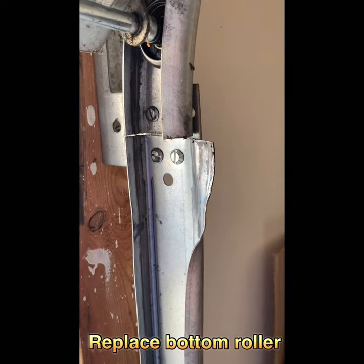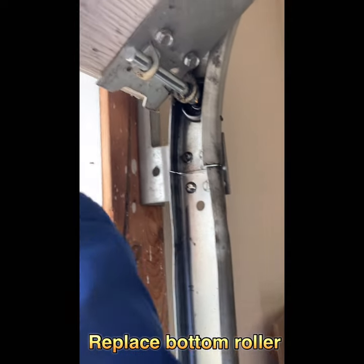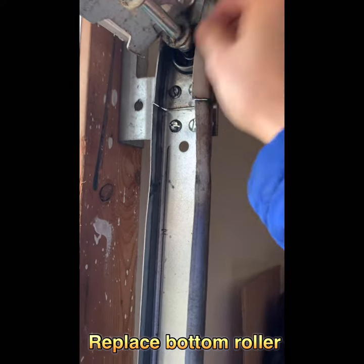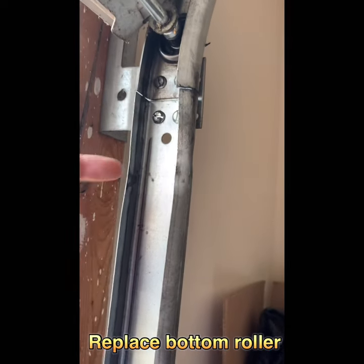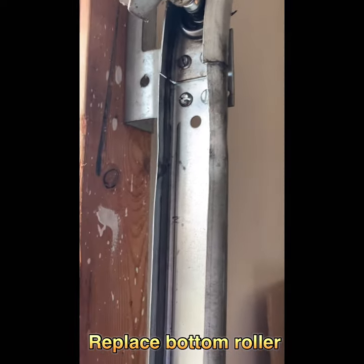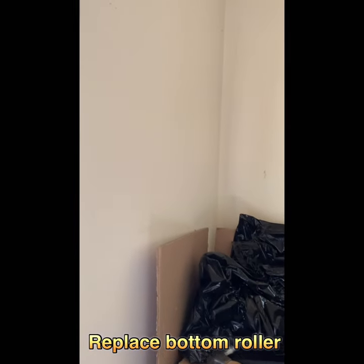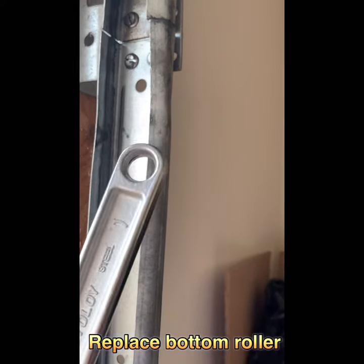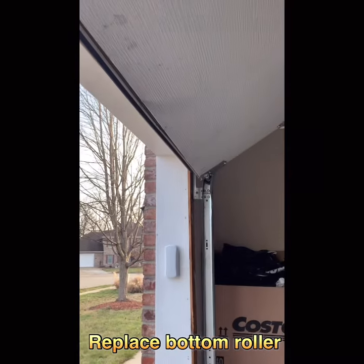I'll teach a small tip: to make it as good as this one, put a hammer here and knock inside. I've done it — I changed the lower roller. Now I want to pull the track around nice and straight. For professionals, they have a special T-shaped tool you can hit with a hammer. Since I don't have that, I'll use a wrench on the inside, and use a hammer to knock the other side to make sure it's a very straight line.